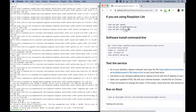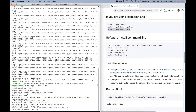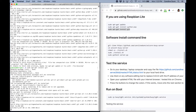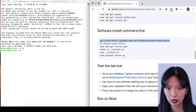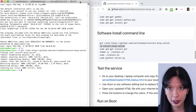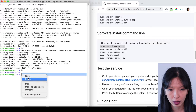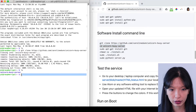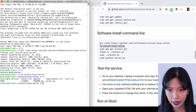Those are the three commands if you are using Raspbian Lite, now known as Raspberry Pi OS Lite, and we need to do that as a prerequisite before we can proceed. Now I'm going to go straight into 'git clone', right-click paste, and git clone my repository. I've completed the git clone. I can hit 'ls' to see that I've created that directory and copied everything over. I'm going to 'cd' into that new directory, paste, and enter. Let's look and see what I have — I have all the files I need.